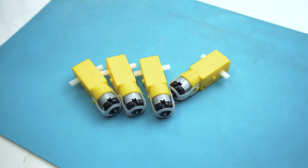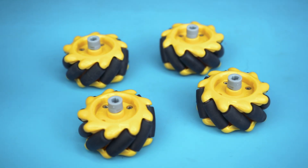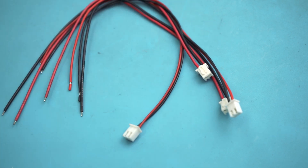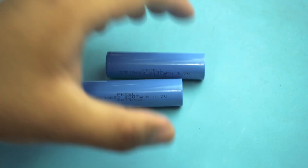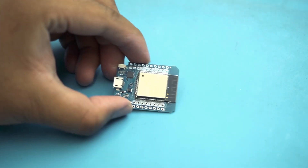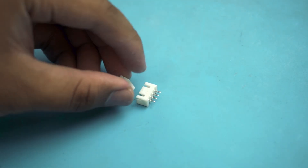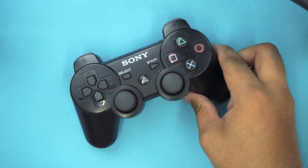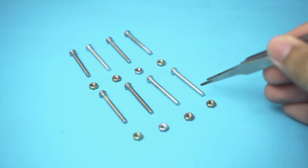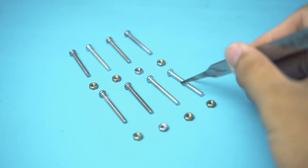Let's start with the things you will need: 4 pieces of DC-geared motor, Mecanum left and right wheel pair, 4 pieces of 2-pin female JST connector, 4 pieces of 2-pin male JST connector, 2 pieces of 18650 battery, 1 piece of 18650 battery holder, a male header pin, 1 piece of slide switch, a female header pin, an ESP32-D1 Mini, 2 pieces of 4-pin female JST connector, 2 pieces of 3-pin female JST connector, a PS3 controller, a Mini-USB, a Micro-USB, the PCB, and the PCB stencil.